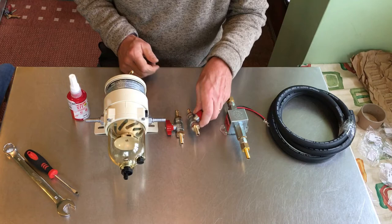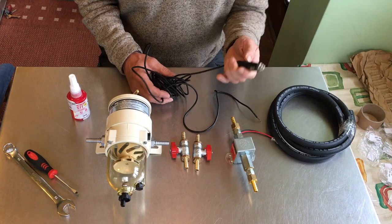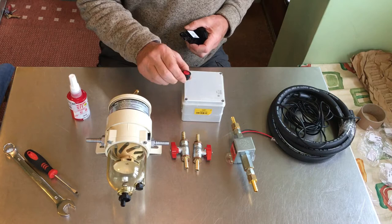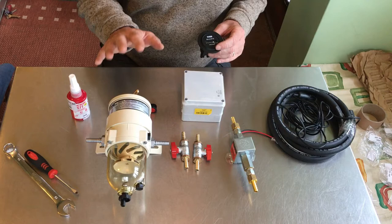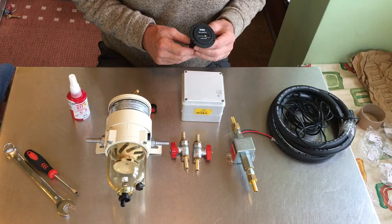The mechanical bit's done and ready to set together, but I now need a 12 volt power supply for the pump. It only draws about 1.5 to 2 amps, so it doesn't need a big set of cables. I already have on the boat an old bit of cable with a 12 volt power supply plug, so in theory I could just use that unswitched. But being an engineer, I wanted a slightly more tidy solution. Within the system I'm going to have a control box, a 12 volt switch, and — going slightly over the top perhaps — a digital hour counter. This will allow me to run the fuel polishing system and keep an eye on how long it's been running. The pump has a capacity of about 120 litres an hour, so I'll know roughly how many litres I've pumped through, and it also gives me a running total on how long the filter in the RACOR will last. Next job is to drill and fit it, then mount it all on a board and put it into a case.